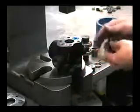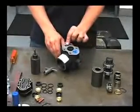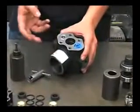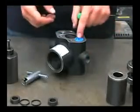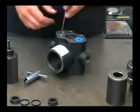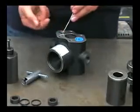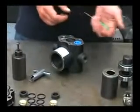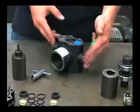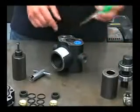Let's talk about the valve. If you've noticed a loss in pressure, it may be that your valves are starting to wear, or if there's an obstruction in one of the valves, that will also give you a loss of pressure. Broken valve springs will cause this too. If the poppets are stuck to the seats from the chemical being pumped, that will also give you a loss of pressure. One thing you can do is blow compressed air into the inlet port — sometimes that can free up a stuck poppet.